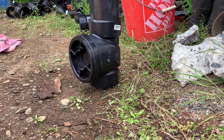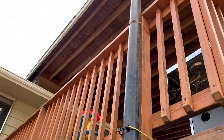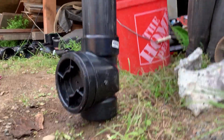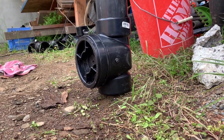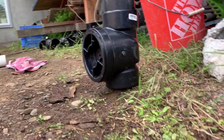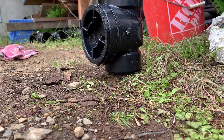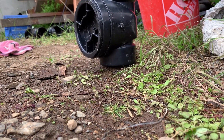My test is complete. I filled this 10-foot piece of 3-inch pipe to the brim with water, and it pretty much held. I calculated that it lost two hundredths of a gallon over the course of an hour, and now it's actually dripping quite a bit less — it seems like the seals have essentially self-healed after an hour or so. It's not perfect, it's still dripping.